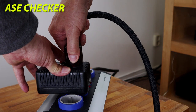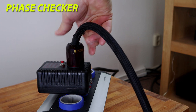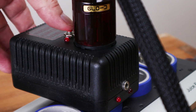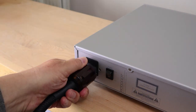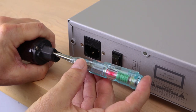This little gadget helps me to find the correct phase. You plug one side of your power cord into the phase tester and the other side into your equipment — the equipment cannot have any other connections and you don't turn it on. Then you push the button and when both red lights light up on the same side you have the correct setting. Remove the power cord from the socket, check where the hot lead is, and mark that side so you only have to do this one time.